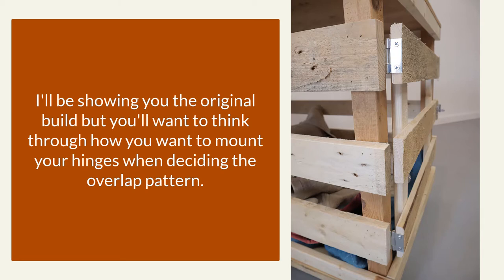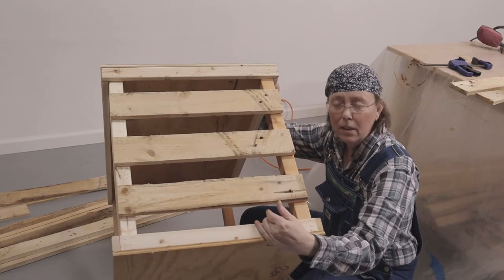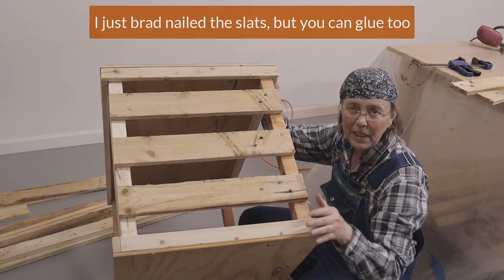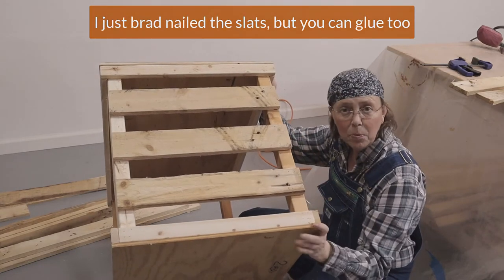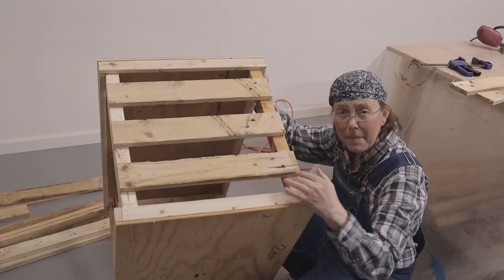However, I am going to show you the videos so you can see the tricks I used to mark the slats. Here's where things get a little tricky. As you can see, I've got the stretchers on the back, and this is old pallet wood, so none of it's going to be exactly the same. With your spacing, I gave myself two inches at the top, two inches at the bottom, and split it in the middle. It gets a little tricky because we've got to do our side and match it to our door.